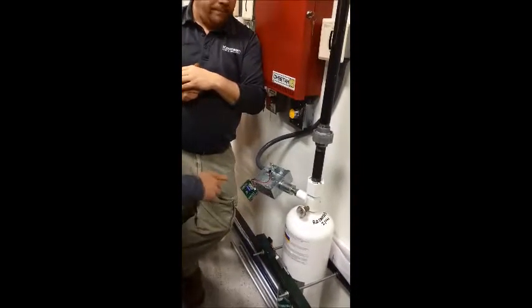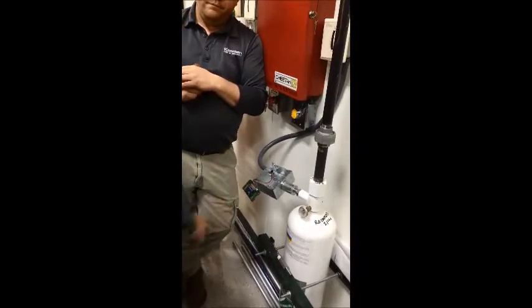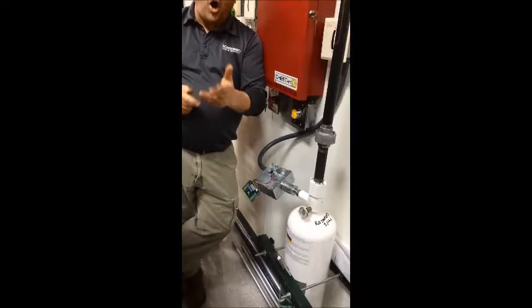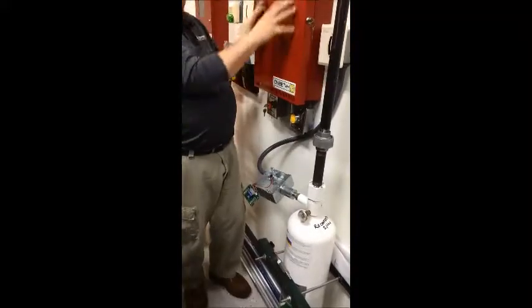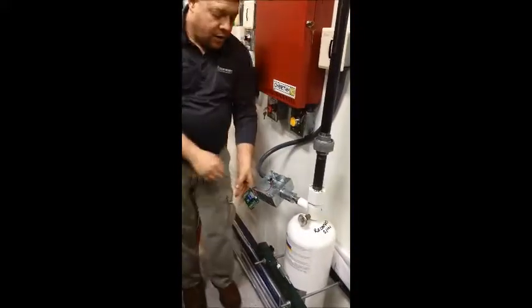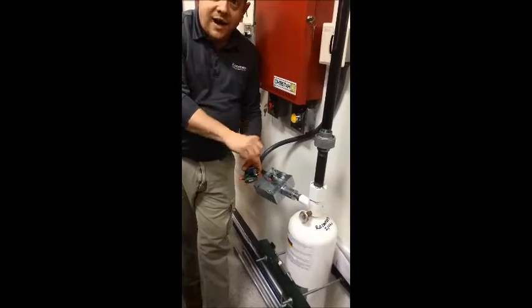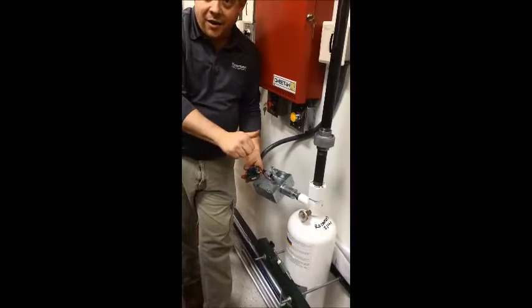So this is where you've got this jumper — that's where the red and blue wires work. Yes. And once you do that, they have to go back in a certain sequence. Going back and rearming, making sure the LED's not on. I pull my jumper off. I'm going red, tighten down, blue, tighten down, yellow, tighten down, green, tighten down.